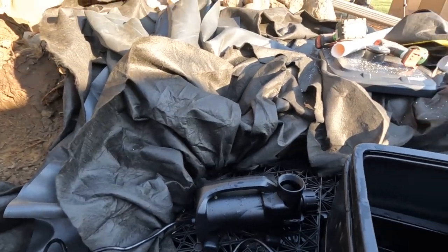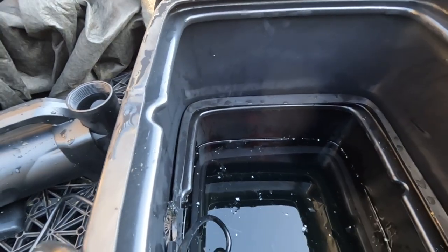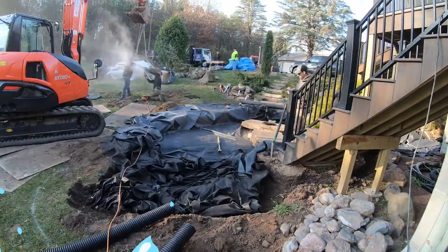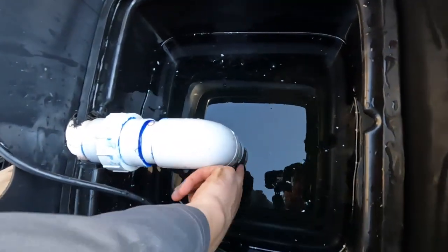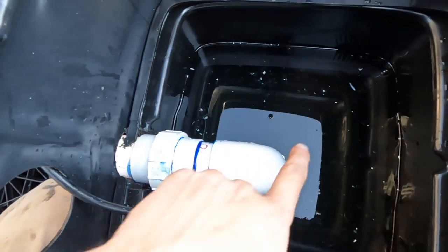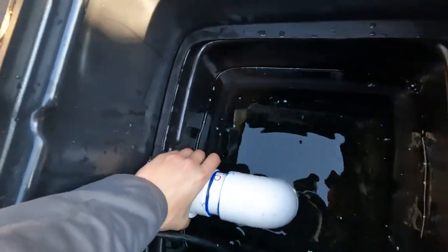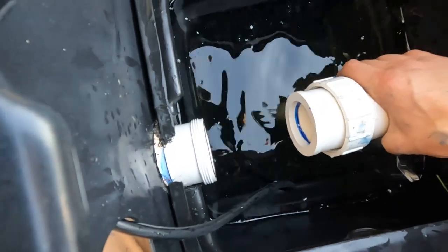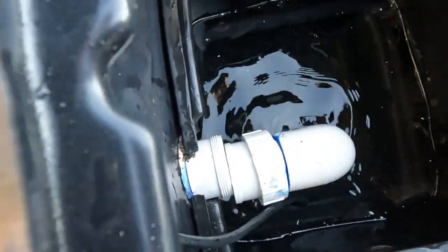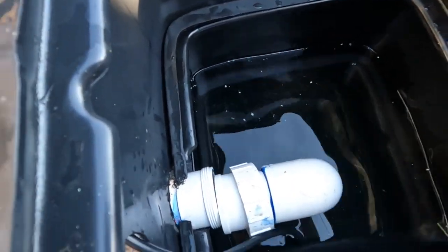I just have to glue everything up and then attach our union so it's nice and easy for pump replacement if we need it. I have my stand pipe down here that feeds the pump, it comes up to a two-inch 90 and then a two-inch union. All I have to do is just twist this off and pop this off to pull the pump out for easy service and maintenance, instead of hard piping everything and having to cut everything out and redo couplings. It's just easier doing a union so we can twist it off pretty easily.